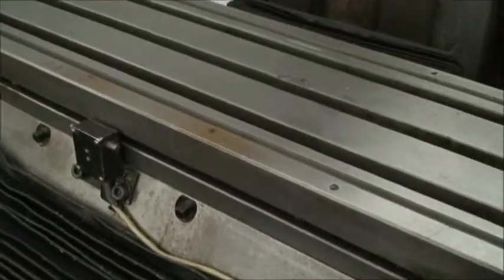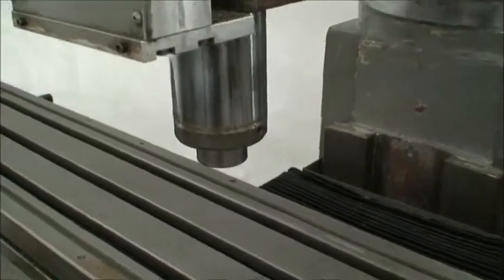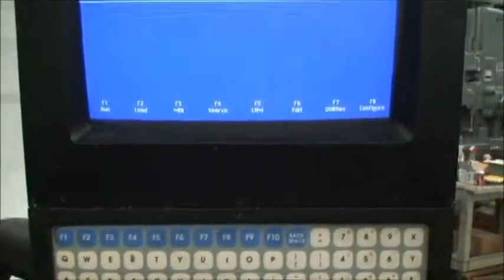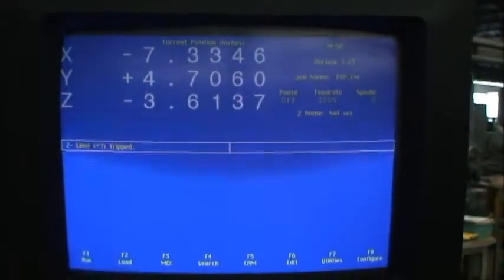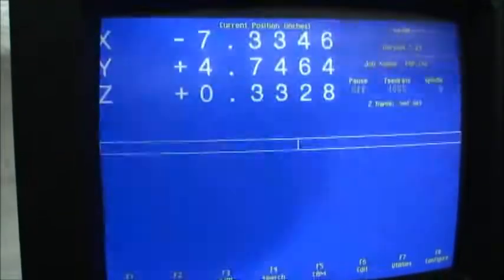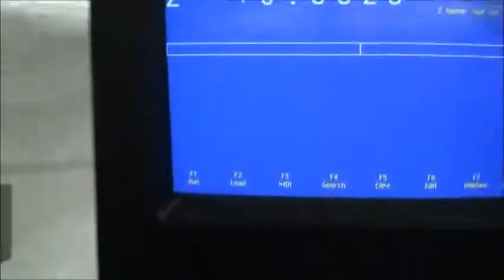You can manually manipulate this machine through the hand wheels. And those ball screws feel real tight. The control will measure in one-tenth increments on all three axes, so it's pretty accurate. I was moving it earlier with the hand wheel and could actually move it one-tenth at a time.